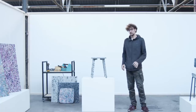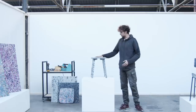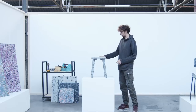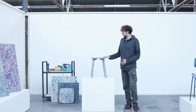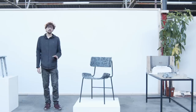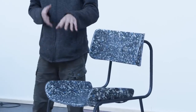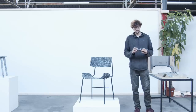The most exciting part is that you can play with different types of material, and each material provides different properties. HDPE and PP are kind of soft materials to work with when cutting, but at the same time they are really tough and sturdy. This tool, for instance, has been made only with woodworking techniques, which makes it really easy to replicate since it only uses really accessible tools. PS is another material that we have been working with, and it offers an amazing property that other materials are not as good at, which is the capability to be formed really easily.